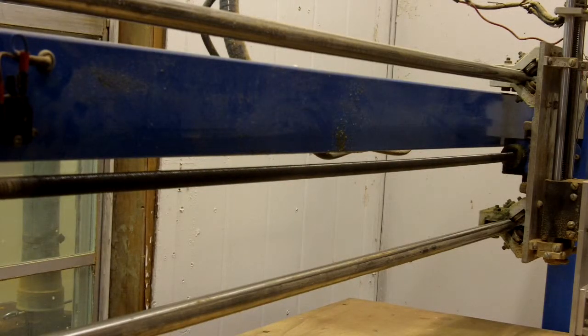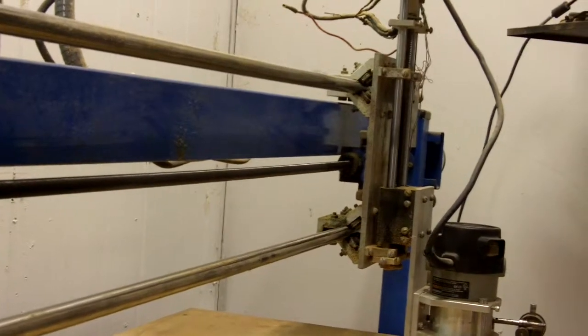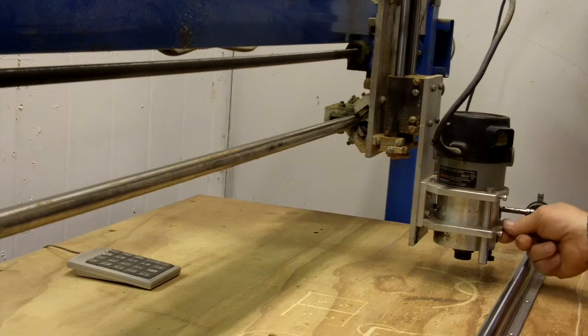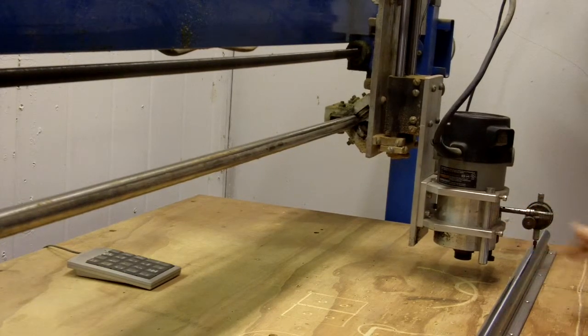You can see the rail's bow if you look closely and compare it to the support I have across the top of the gantry. You can almost see the bottom of that bowing. I'm going to swing you around here a little bit to give some idea of how much deflection I get when I run into a problem. You can probably see that moving - which is the bottom rail pushing away. Hopefully I'll be able to get rid of all of that with the supported rails.